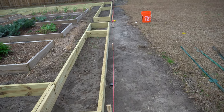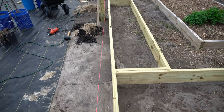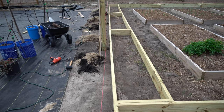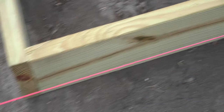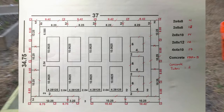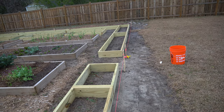What I did was I took a string line and ran it around my entire garden exactly 4 inches off the sides of my beds, and that is going to reflect the center line of my posts. I was able to set the first two. I'm digging this with a manual post hole digger and it's really easy until about 18 to 24 inches, then I start hitting tree roots — 6 inches of misery — and then I'm back into pure sand and it's easy digging again. After pulling my string line, I put markers where all my posts are going to go, determined by detailing everything out on a plan with exact measurements.